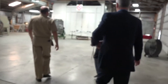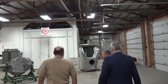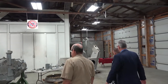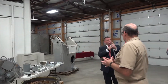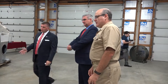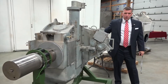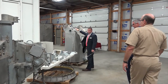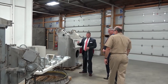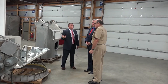This is the MK82 pedestal — this is how it comes to us. We have a contract to do 12 of these. The MK82 pedestal is what turns the 62 reflector and puts it in position. This is the director itself — these two pivot arms mount inside the pedestal, and that allows it to turn or rotate on the ship so we can direct the missiles to be shot off the ship.